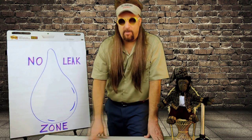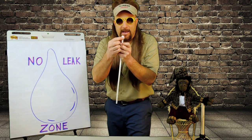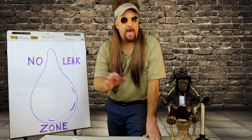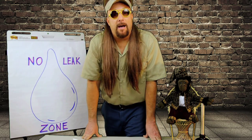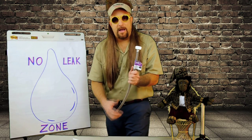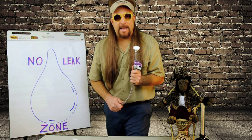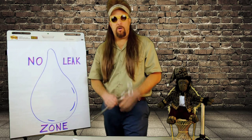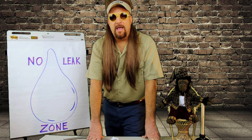Now, on the sizing — make sure you match up all the sizes. A lavatory supply line can be mistaken for a toilet supply line. The only difference is that the latter has a bigger size connection on the fixture end. Both of these supply lines are normally 3/8 inch in size, but can be half an inch. This is important because you must match the supply line to the size of the outlet of its respective shut-off stop. Toilet supplies come in either 12 or 20 inch lengths, while sink supply lines are usually 20 inch and longer. Keep in mind that supply lines are tubing and are measured OD — outside diameter — while piping is measured ID, or inside diameter. Ice maker lines are normally quarter inch. Wash machine lines have hose end connections, while dishwasher lines often have 3/8 inch female nuts on each end that thread over top males.